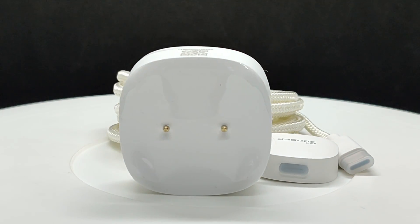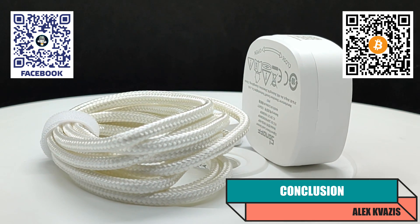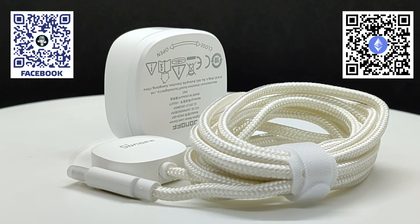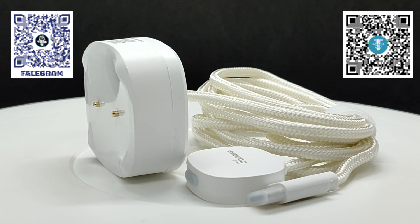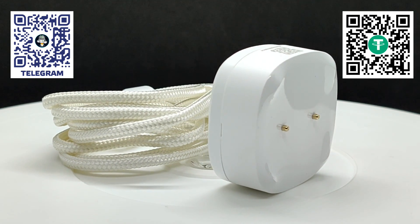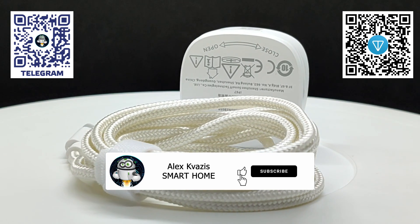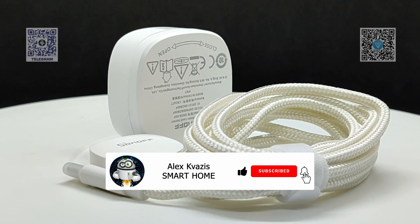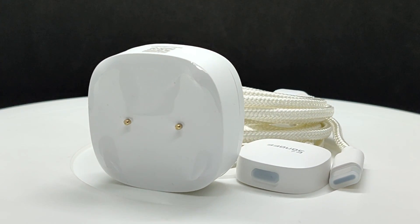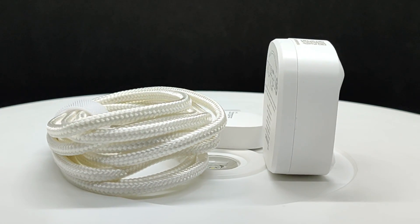Functionally, this is an ordinary leak sensor, but in terms of design it has interesting differences: the ability to detect falling droplets and the option to extend coverage with a water-sensitive cable. If using the cable, I recommend sealing the USB-C ports with plugs. The sensor is supported in eWeLink and Tuya Smart, though Tuya has an issue with transitioning to offline status, even though the sensor continues to detect leaks. It works fully with Sonoff iHost and in Home Assistant through ZHA and Zigbee2MQTT. That's all for now. I hope this video was helpful and interesting. I'd appreciate your likes — they help with YouTube promotion. If you don't want to miss new videos, subscribe to my channel. In the video description, I will leave links to stores where you can purchase this sensor, my Telegram channels and social networks, as well as discussion groups for smart home topics. Thank you for your attention, and see you next time. Peace to all.